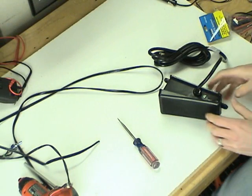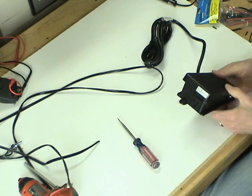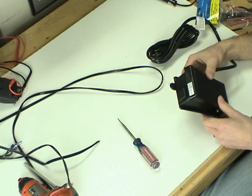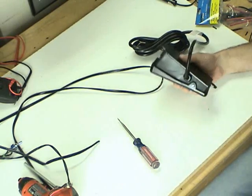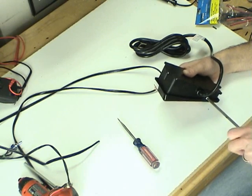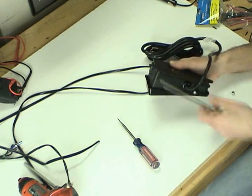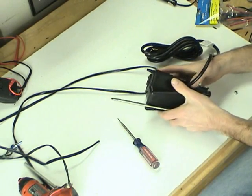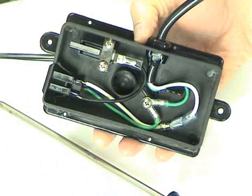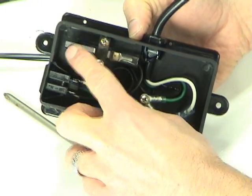Here we have another kind of switch called a billy pedal, used to activate a tool in your workshop. You actually plug the tool into the end of this pedal and the other end into the wall, and when you step on the pedal, it lets 110-volt electricity go to whatever tool you're trying to operate. We're going to use the housing from this pedal for the motorized router lift. That involves removing the cord that's there and basically doing the same thing we did to the sewing machine pedal — connecting to the contact switch on the inside. After I open this up, you'll be able to see what makes this switch work. We'll remove all the wiring for the 110 and just bring a line in and wire into this contact switch inside the nice housing.